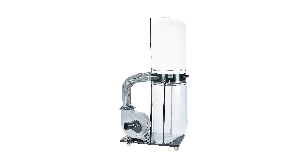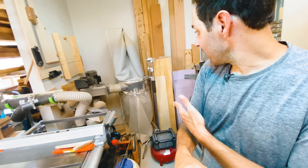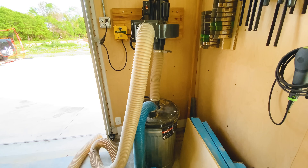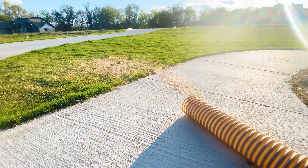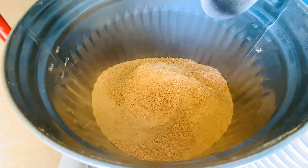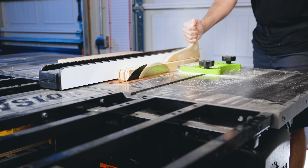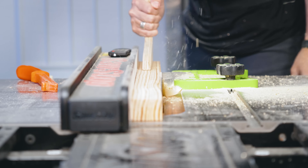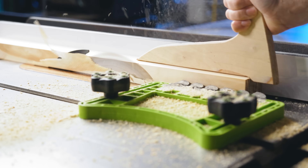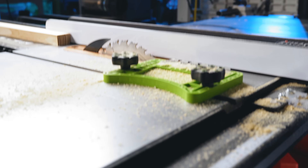If you're like most woodworkers, you've probably seen or even have a cheap dust collector like this one. I've had two for many years and they don't work that great. I've never really loved mine and in an effort to maximize its suction, I've tried a lot of things including removing the bag filter, exhausting it directly outside, and even adding a cheap trash can cyclone separator. This kind of worked until my shop grew and most notably until I got a table saw, which are notoriously bad at dust collection — unless you take advantage of two four-inch hose ports, which my Harbor Freight dust collector could not do.